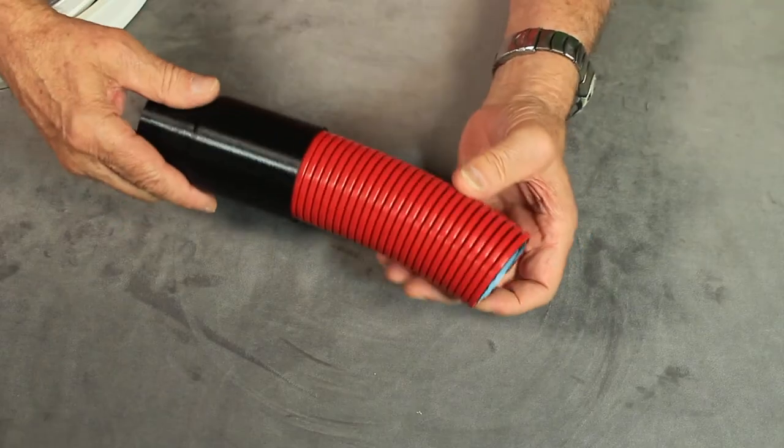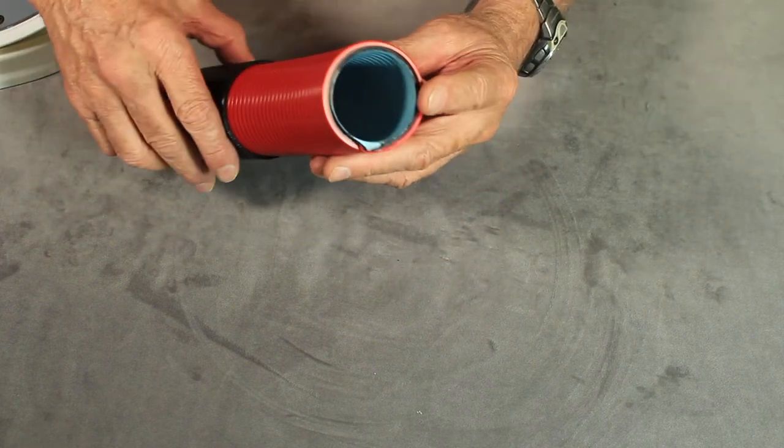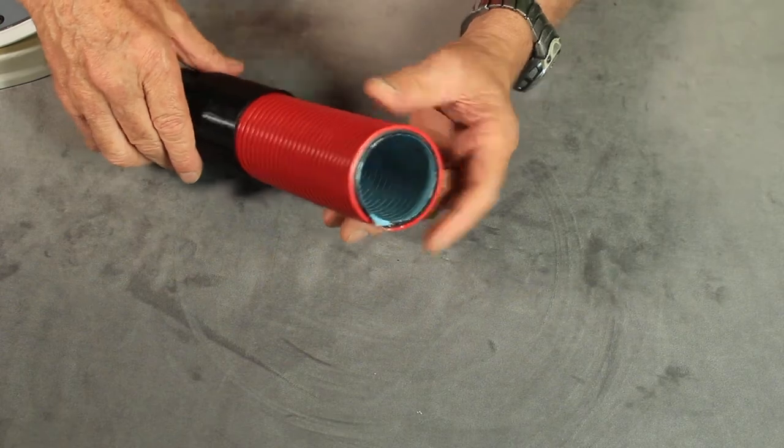In addition to these cyclonic lids, we found that if we used a higher flow rate, low resistance vacuum hose, we could improve the performance of our shop vac by 20%. This is actually a major improvement, especially when you're dealing with materials like gravel and rock. With our rigid shop vac, we were pulling a pound a second through these hoses, and it just did exceptionally well.